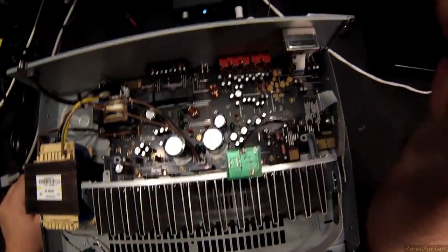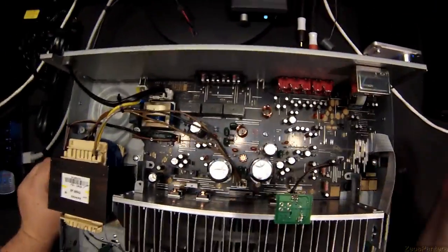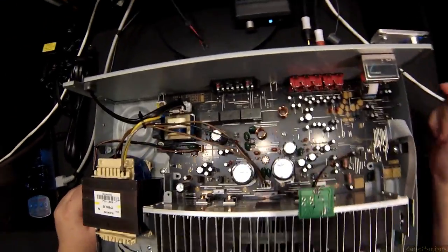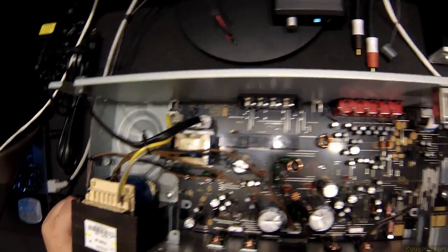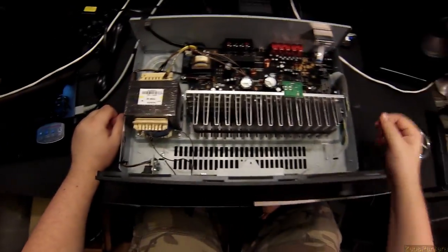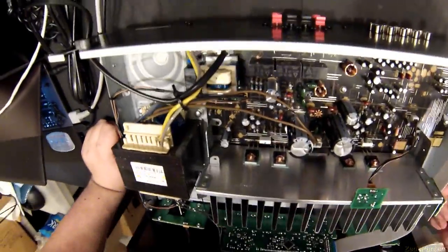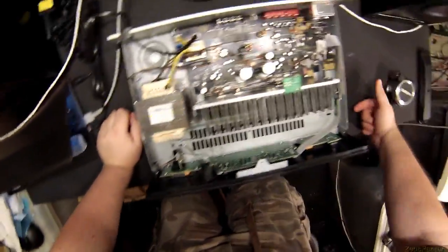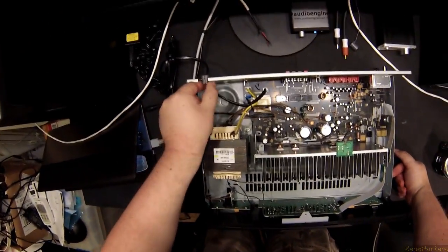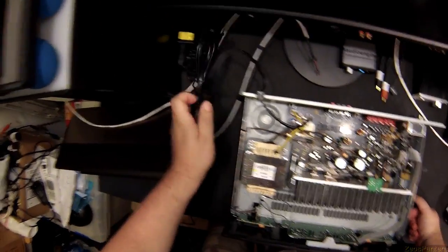Some nice little components in here. It's simple, plain. They're not even doing solder traces, they're doing external traces. That's perfect. Quality caps, can't tell. Chinese relays. Are those Chinese relays? This might be Japanese relays. A little thing here's for the antenna. It's standard fare. There are your 4 amplifiers. I mean, it's well built. I'm giving this one away, so I'm not going to modify it, but if I were you, I'd consider making a detachable plug, because it really sucks when these things don't come off.